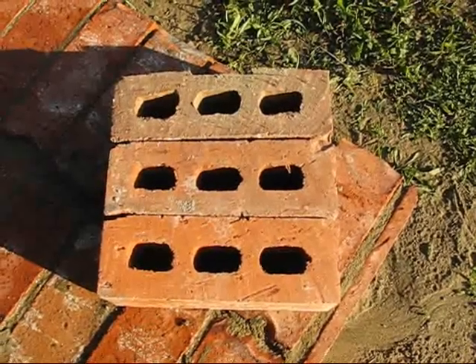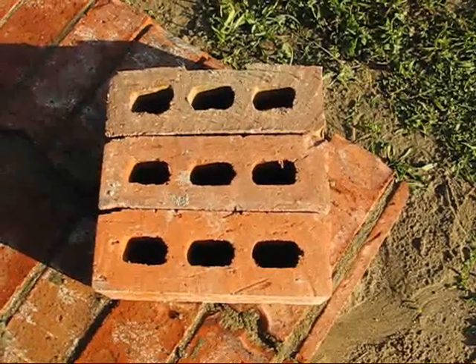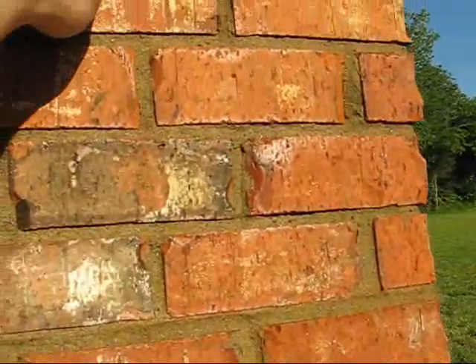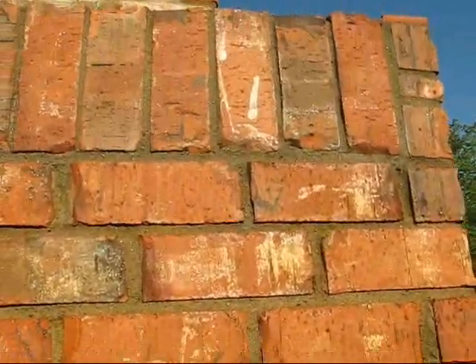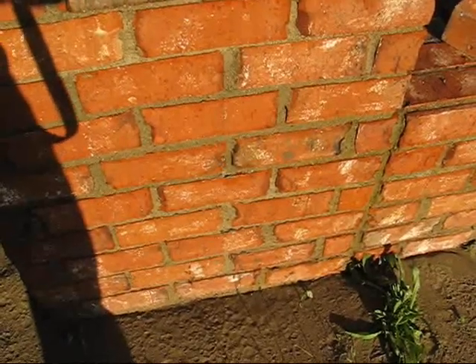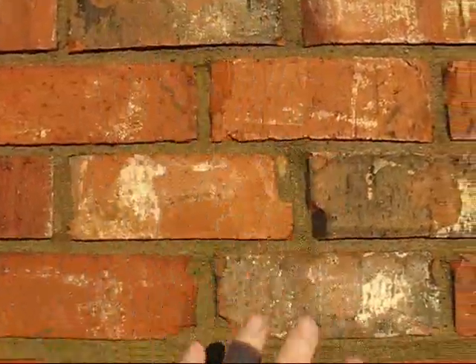The outside bricks still get cooked harder and more firm than the inside bricks, giving a different color. This also makes them shrink more, because as they dry during cooking they get a little shorter. So sometimes on a wall you'll see too many dark bricks in a row and you'll notice the head joint — that vertical joint right here — isn't perfectly straight. From the bottom to the top, whether it's one story or a hundred, those joints ought to line straight up.